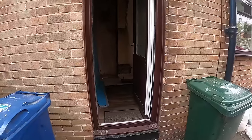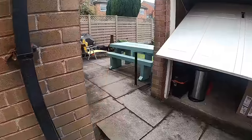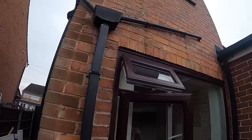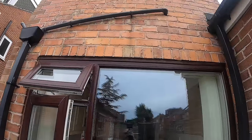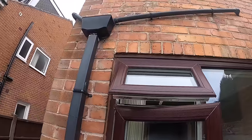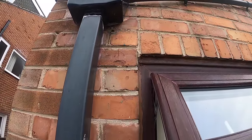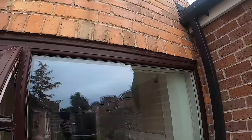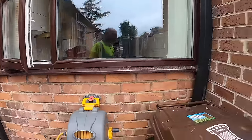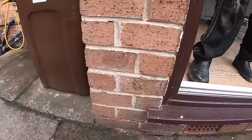This is our job. Well, before we start that, put a lintel in here next week, I think, or at the weekend. That's a job coming up. Take the brick and edge out, put a tray in and everything, and lift it one course, and then take the brick and edge out, put a course of brick back in. That's coming up.